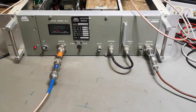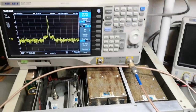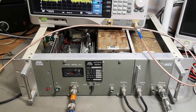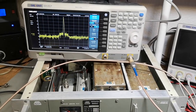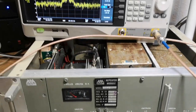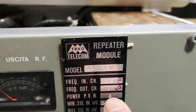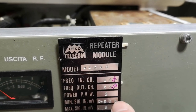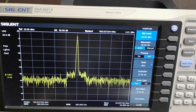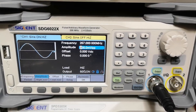I've got the unit up and running. I'm running attenuators on the input and I'm still able to overdrive the analyzer — this thing can definitely deliver a lot of power. The frequencies are not correct though: channel 57 should be 728 MHz but the output is showing 762 MHz, which is a little bit weird.